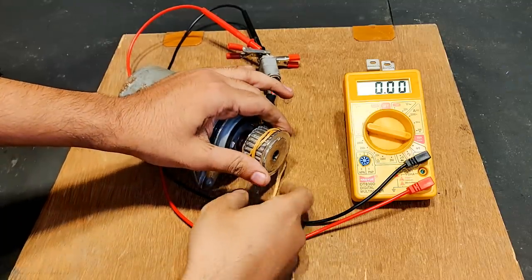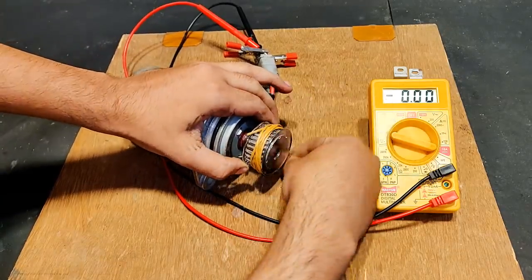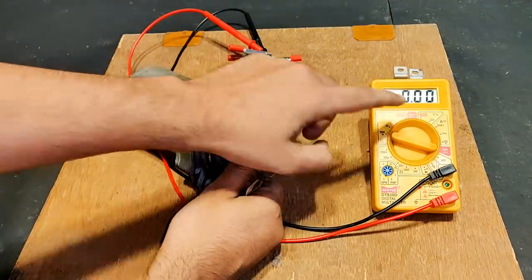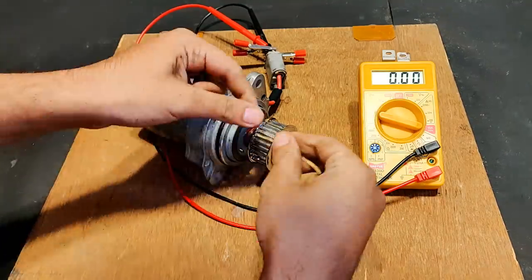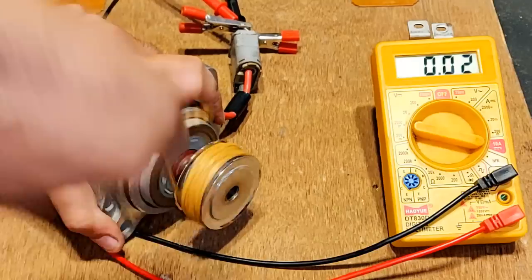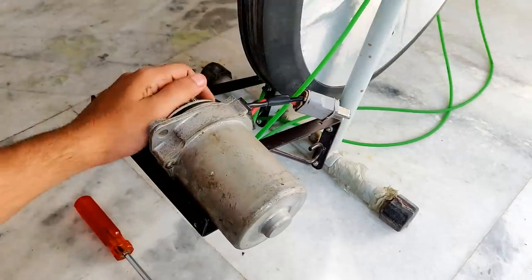I put really little power because I knew the current was going to be high and this meter can only support 10 amps — any more and the meter can get damaged. I'm going to take it to 10 amperes, and as soon as it displays 10 or more amps I'm going to stop to protect the meter. 9.45 amps — I'm planning on pulling it even harder. 10.07 amperes, as I said! Let's mount it on the e-bike and see how much voltage I can generate.